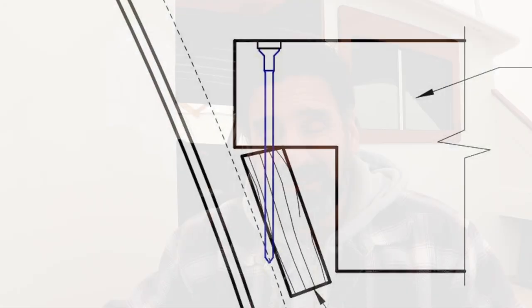So basically what I had to do, and I kind of wanted to improve the design a little bit first, was remove those and fill all those old screw holes with epoxy and get that all straightened out. Then I epoxied the backs and the bottom sides and reattached those with the screws and some thickened epoxy as well. So it was a little bit better, stronger connection there.